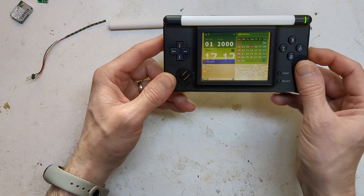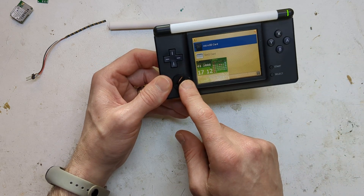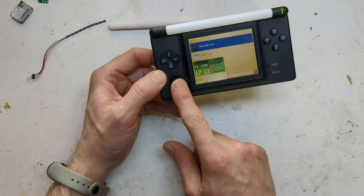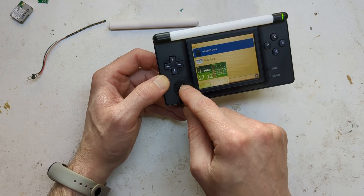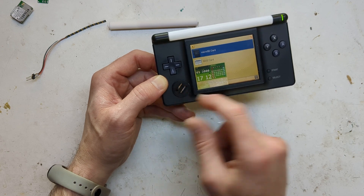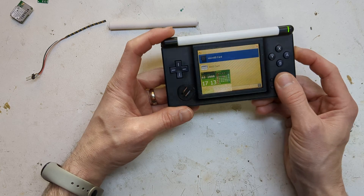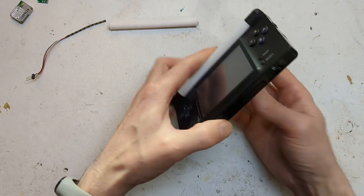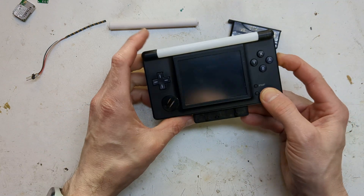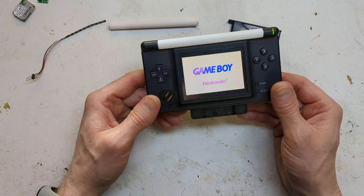You can easily click on and off at the touch of a button, which is really nice. It's got the front-facing PSP speaker. I've got a little jig for that — I'll put the notes in my blog as well. There's a little jig to drill the hole, it's a 16mm hole, and then you glue a cap over it and you can put the PSP speaker in a normal shell, because you want to keep the light bar. It also plays GBA games just like normal. It's quite loud.